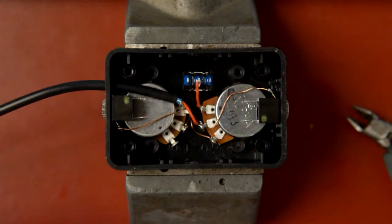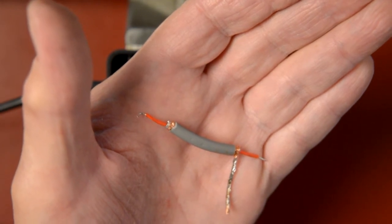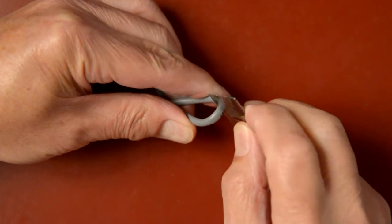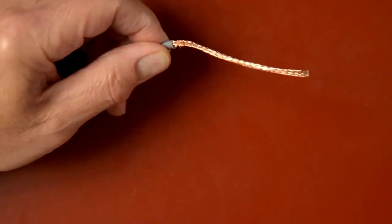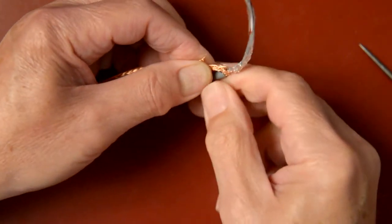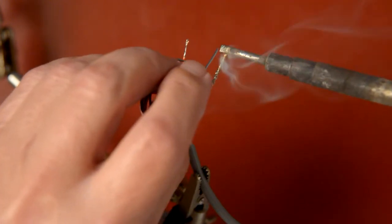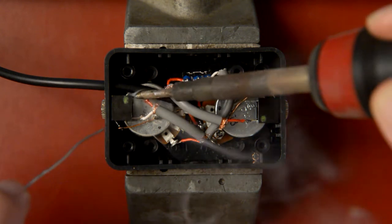Another tip is to make a good physical connection before soldering. Now I need to make a couple of jumpers for the remaining connections. I'm using shielded cable out of an abundance of caution to reduce the chance of picking up any stray noise or crosstalk. Removing the outer insulation from shielded cable can be a bit tricky, and here is where the razor blade comes in handy. Using an awl or ice pick, extract the inner wires from the shield and twist the shield into a single strand. Again, pre-tin both signal wires as well as the shield. Finally, I solder both jumpers into place and solder their shields to the bare copper ground bus wire.